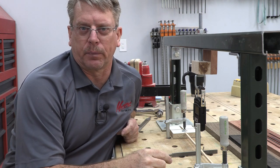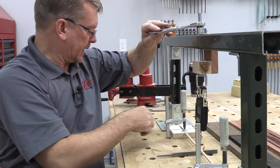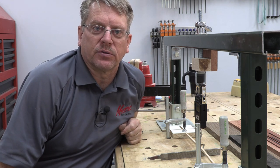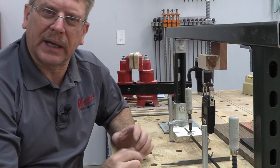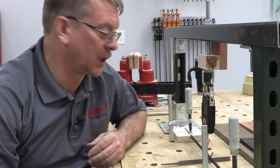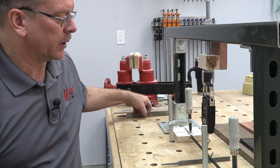Now for the maple - that should have been our control piece. Starting at zero, cranking up to 10 millimeters of flex: 5.75 pounds of pressure. Pretty significant difference. I'm trying to keep all the variables as constant as I possibly can - I'm no mad scientist. Maybe mad, but not really a scientist. Some of you that are engineers may see this as frivolous, but I think it does give us some indicators of strength that would be corroborated with official scientific data.